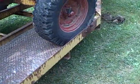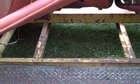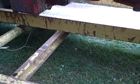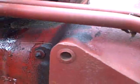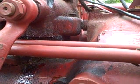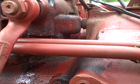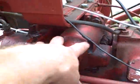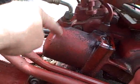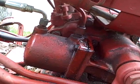A couple of things I made note of while I was trying to drive it on. First, I'm leaking hydraulic fluid like a sieve over here. That's coming out of the bottom of the steering gear box. And if I understand the way this works correctly, there shouldn't be hydraulic fluid in the steering gear part of the system here. The only fluid should be going in and out of this cylinder. So this cylinder may be leaking into the steering gear box. That's my theory at this point without taking it apart.